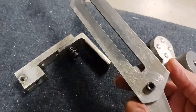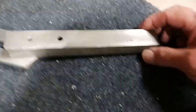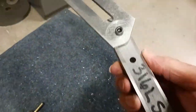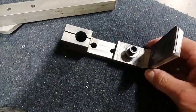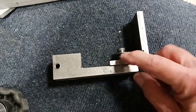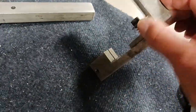I put a slide in and just cut it on a band saw. It's got three different holes for different adjustments. The piece on the back is a counterbalance weight, because when you stick it way out it wants to fall down. So I've got this piece of stainless on the back as a counterbalance. This little piece of steel is bolted onto the aluminum angle and has a spring in there with a bolt so it can pivot back and forth for adjustment.